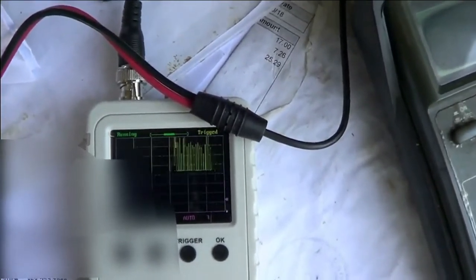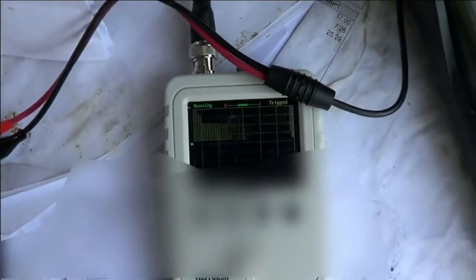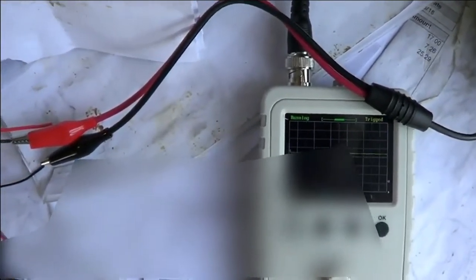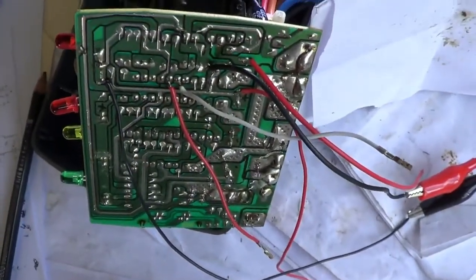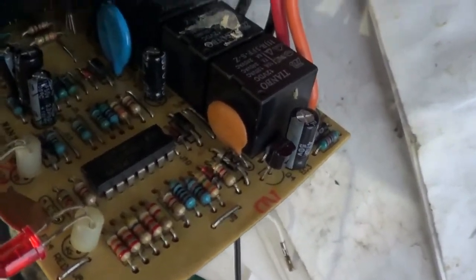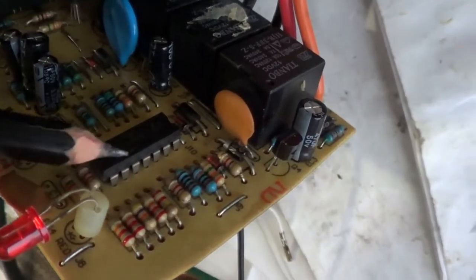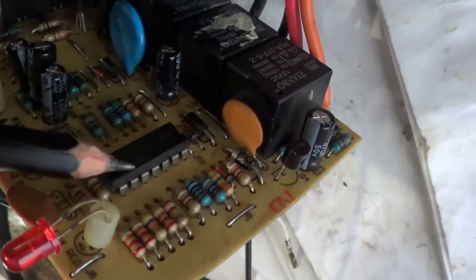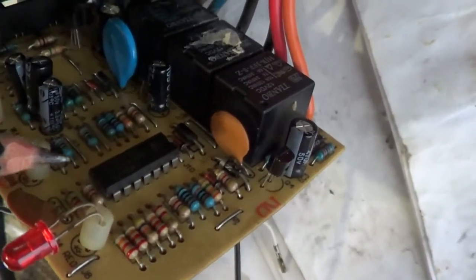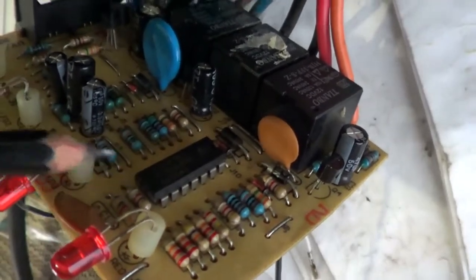You can see on the oscilloscope that it is pulsing. This leads me to suspect maybe it is a capacitor that is bad, or it is probably a diode, or it could be the IC itself that is faulty. Pin 14 on this IC controls one of these relays. The thing is, this is just a quad op-amp IC, and there are no inputs on pin 13 and pin 12 — that is the fourth op-amp. With no differential signal, there should not be any pulsing on the output of the fourth op-amp on pin 14. So the IC could also be suspect here.